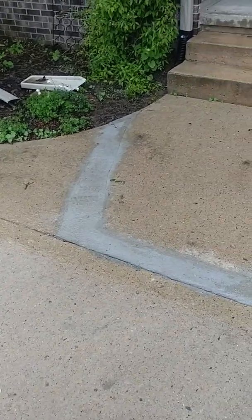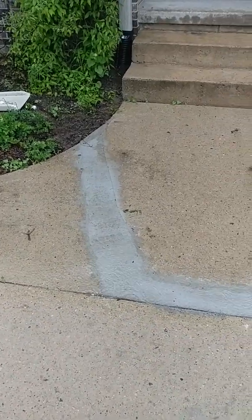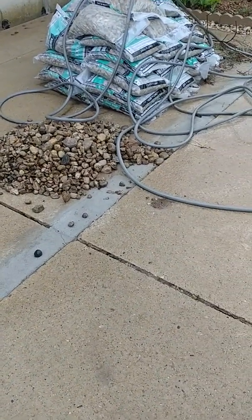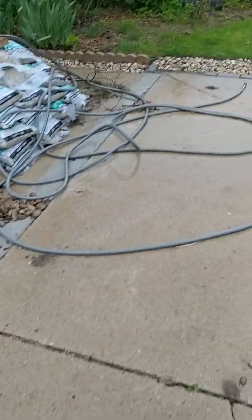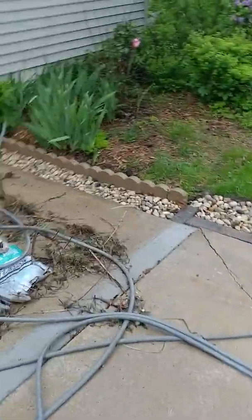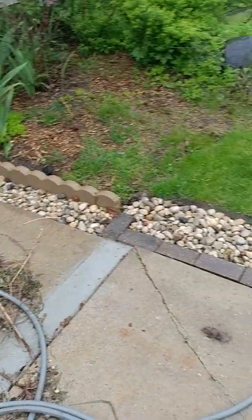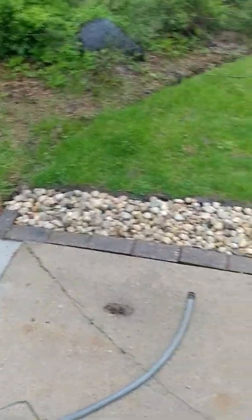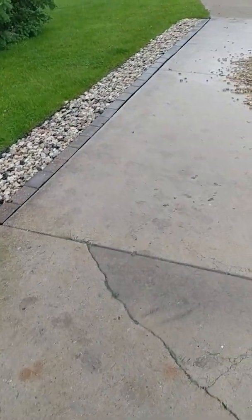So I sawed the driveway and got solid dual-wall four-inch pipe going through there, because there isn't a ton of slope — I learned that from French Drain Man. I use single-wall for all the corners. I even put a little stone down around that pipe and wrapped it, even though it's solid, so water that gets under the slab has a way to get over to this French drain here. This has really helped the sump pump issue a lot. The solid pipe makes a right corner, but the slotted stays separate, so now I've got two pipes going down this French drain — all dual-wall four-inch solid.